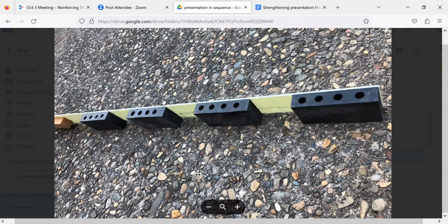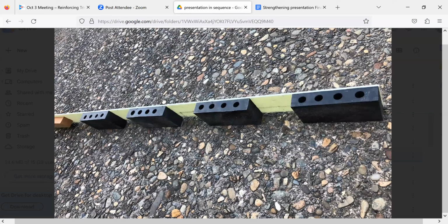This is a bumper kit that's vertically the back end of my dagger case. To be fair, this wasn't designed, but I ended up shortening the dagger board front to back because it was too flat and it vibrated. So I basically created a higher aspect dagger board, and there was room to add this bumper strip in the back. If there's a grounding or a strike, this fairly soft durometer rubber will absorb the blow. It's just the idea of putting your car's crash bumper inside your box.